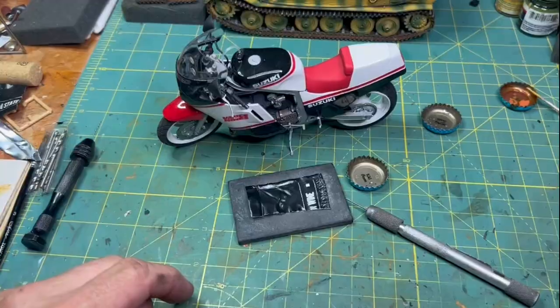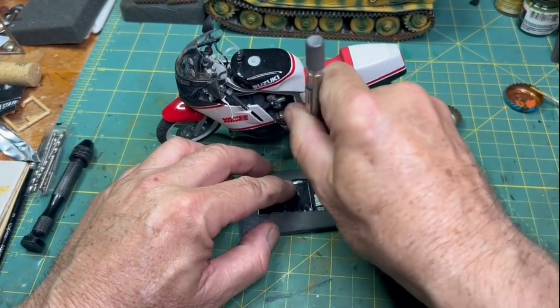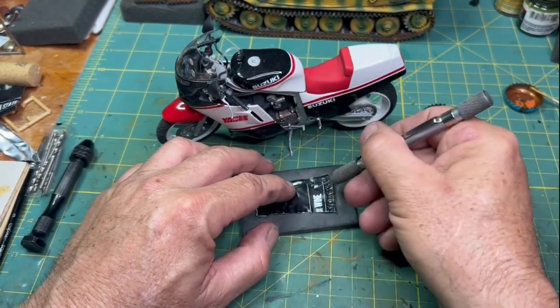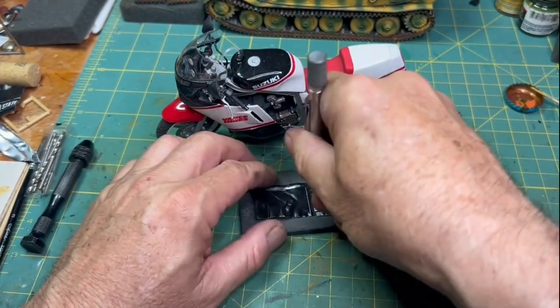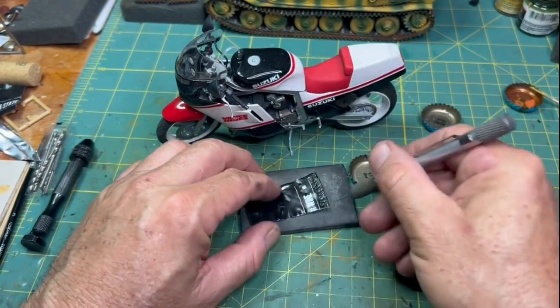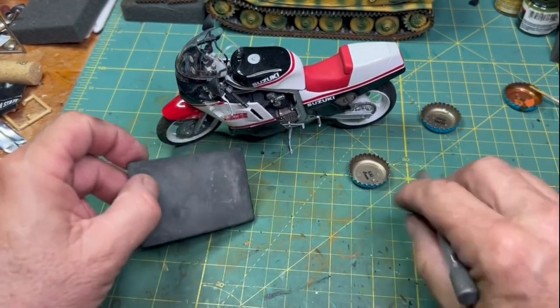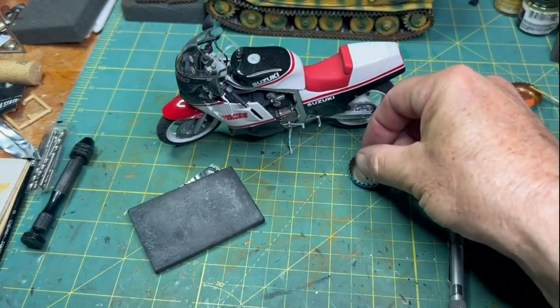After the polishing was complete, I had to come back and add the fairing fasteners. Now, the way I had to make these was using a piece of foil with a drill bit, and you place the foil over a hard rubber mat. It has to be a little bit flexible. A sanding squeegee made by 3M works. You can get those at an automotive body shop supply. Probably find them online, even easier.